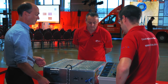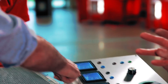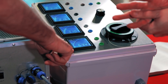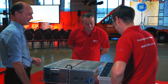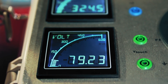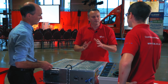If we put some more imbalance on the system — so one of those phases is even lighter loaded — this third phase has got quite high, over 300 volts. These two phases are still reasonably well within tolerance, at 216 volts which is about minus 6% on 230. And we're approaching that 70 volts on the neutral, so this is going to tingle quite a lot. Then if we put a bit more imbalance on the system, we get to the point where we're well above 70 volts, where a voltage protection using an earth rod would trip. But a voltage-only measurement based on the proposals in Indent 4 won't take you off.